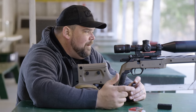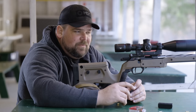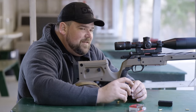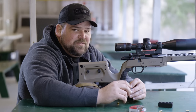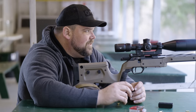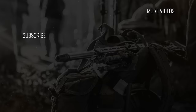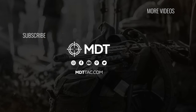So probably right around a half-inch group at 50 yards, or one MOA we'll call it. I'm sure if you tried some different ammo you'd probably get a lot tighter than that. But we definitely saw the big difference between a damaged crown and how much of a difference it made, and then going back to a proper, cleaned-up, well-done crown. So make sure you keep that crown protected, because if you do damage it you will definitely see the effects down range.